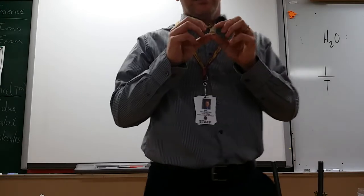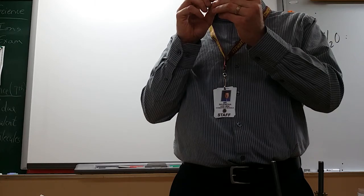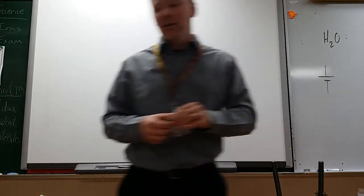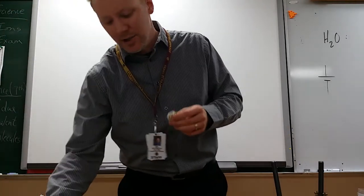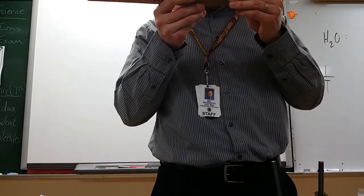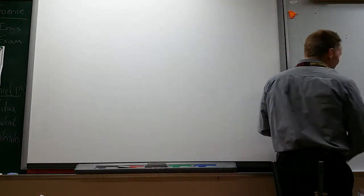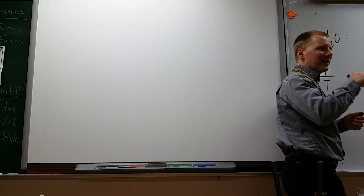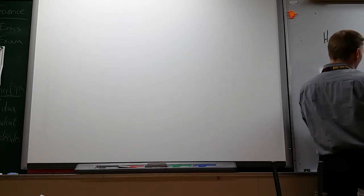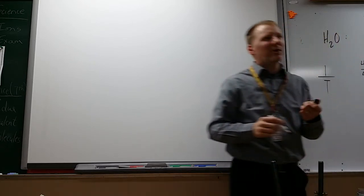40 centimeters here has, let's count, 1, 2, 3, 4, 5, 6, 8 coils on it. 7 to 8. But the other thing with this is that if I measure the approximate size, I can get that each side of this, it's a square, and it's about 1.2 centimeters. So if we have 1.2 centimeters on a side, that means 4.8 centimeters circumference. And we have 40 total centimeters of wire. How many coils should that be?